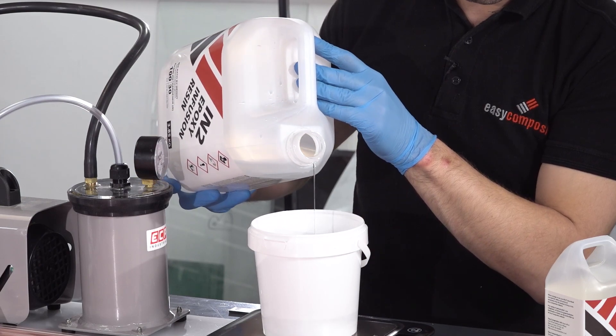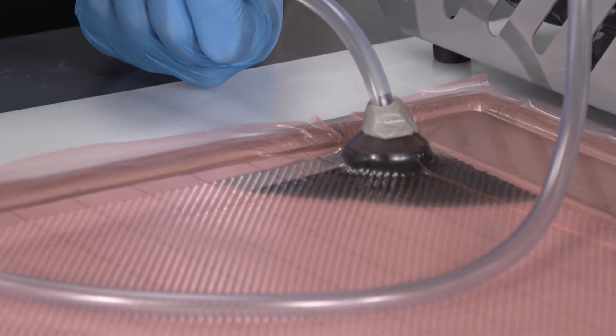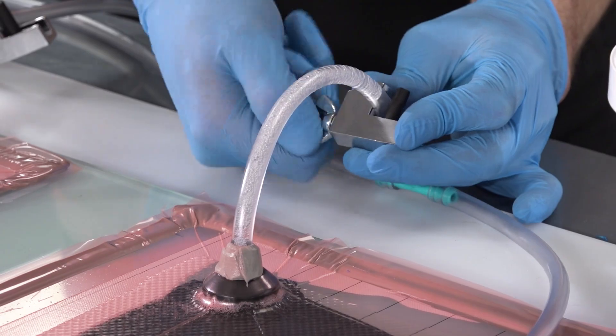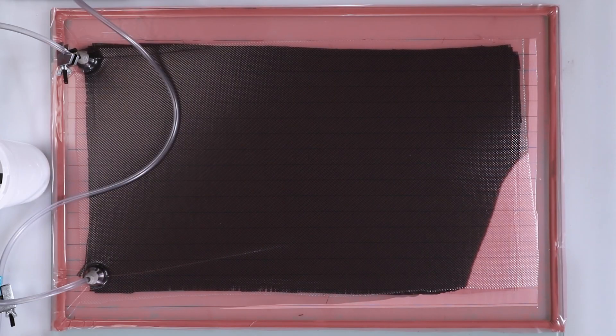With the first test, you can see that the resin front meets the vacuum line before the part has even halfway infused. In order not to draw too much resin through the part, the vacuum line is clamped off at this point. Because the rest of the part is almost at full vacuum, it will continue to infuse for a surprisingly long way, only stopping at the very last point where the air pressure in front of the infusion reaches equilibrium with the resin pressure. If you had a perfectly absolute vacuum and no air or off-gassing from the resin, theoretically the part would fully infuse. However, this is only good in theory, and in practice an incomplete infusion is almost unavoidable. There is a trick to fixing situations like this — look out for it in a future video.